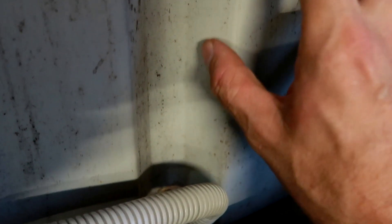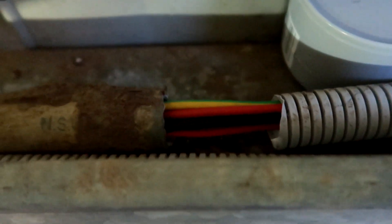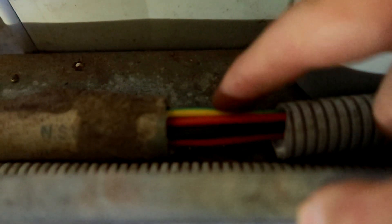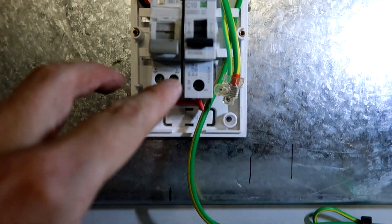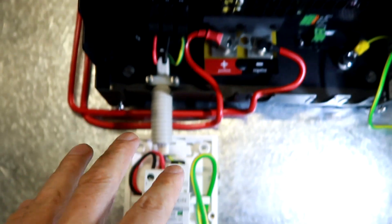There are only two steps left. This is our incoming cable from the meter box on the other side of the wall - the incoming cables for the power points and the light circuit. There are two actives (red), two neutrals, and one earth. Tomorrow we will cut this off: the active ends go into a junction box as a dead end, and all this cable will be connected to our switchboard here. This is our feed from the inverter, through the switchboard, RCD, and circuit breakers into the main garage system - all power points and lights in the garage will be powered from this inverter.